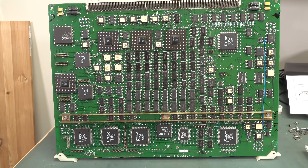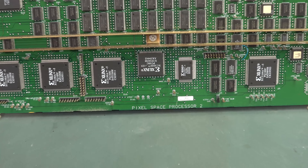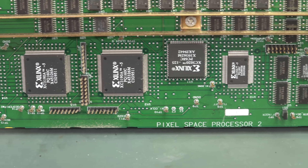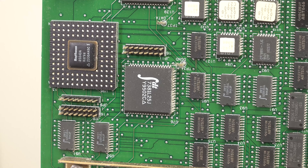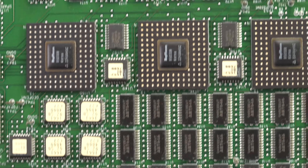This is the Pixel Space Processor — it does scan conversion, zoom of the ultrasound window, scrolling graphics, and freeze display. Obviously a ton of memory to hold it all. There's quite a lot of Xilinx FPGA action here — XC3190As. Anyone remember those? Really old school. Can you even buy them these days? And IDT parts — they do some of the best FIFO memory. Then we've got some Raytheon ASICs — what the hell are Raytheon doing in here? It's a 10-layer board. Spared no expense.